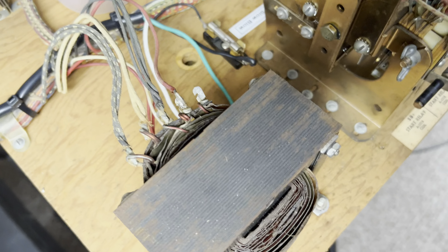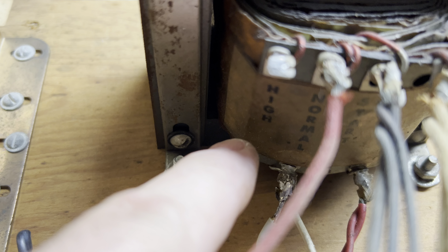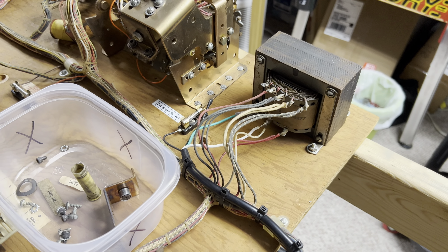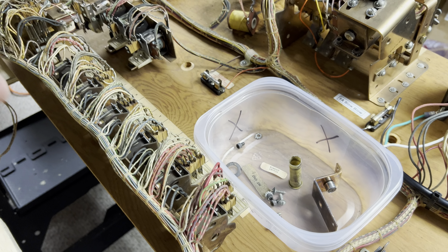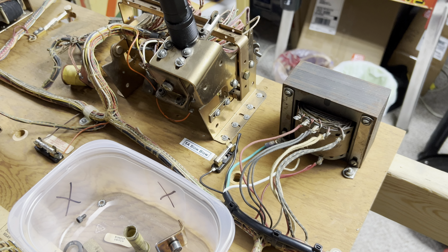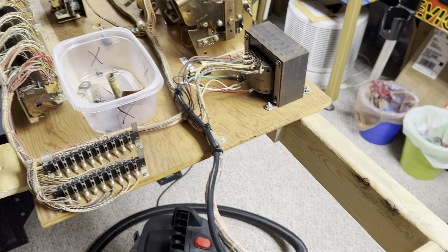This was high tapped — I took it off high tap. I don't know why it was high tapped. High tap actually just gives all the coils and solenoids more juice to do their job. However, with that more juice, if you got something stuck you will burn it out very quick. Trust me, I know that from experience.